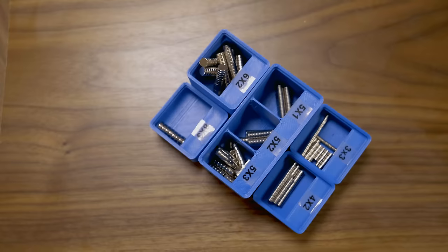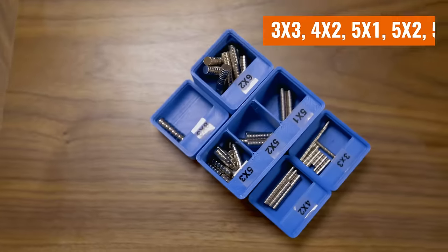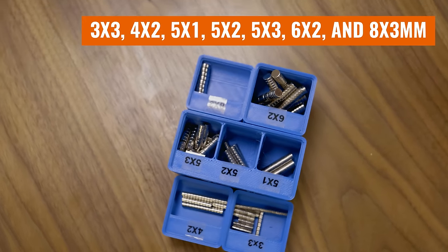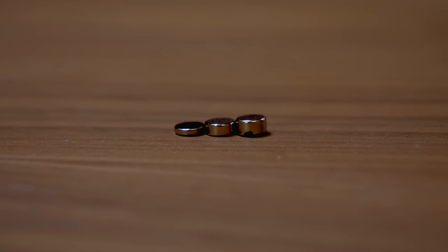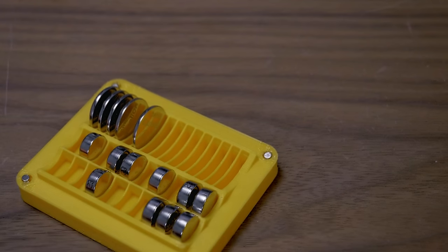Your best bet, then, is to just buy an assortment of magnets and store them nicely and neatly in a Gridfinity container. They don't sell actual assortments, but you can find any good seller like the ones I've linked in the description and just add a bunch of different ones to your cart. Personally, I keep 3x3, 4x2, 5x1, 5x2, 5x3, 6x2, and 8x3 magnets on hand at all times. These magnets aren't that expensive, and while you can fudge it on depth, you definitely don't want to get stuck not having the right diameter.